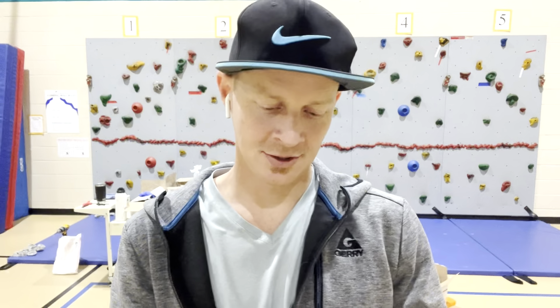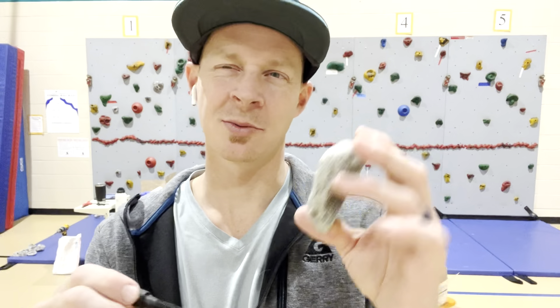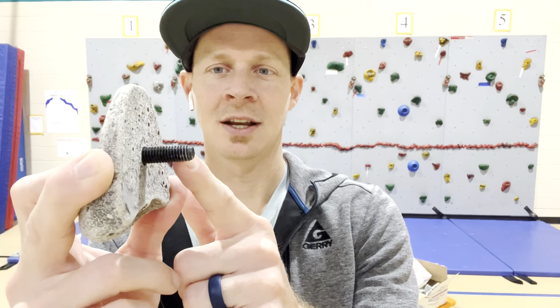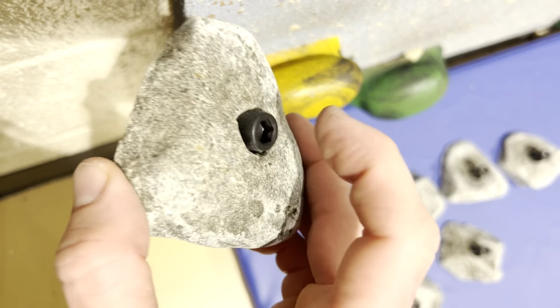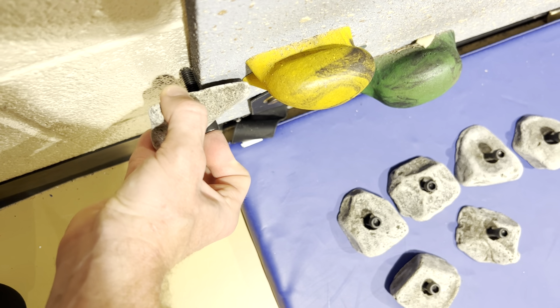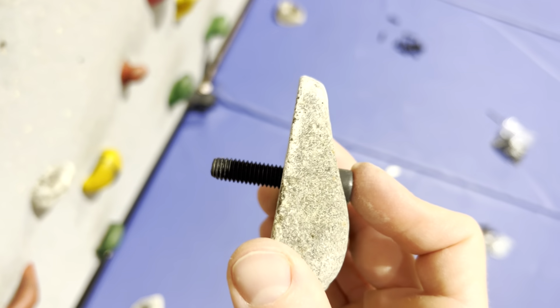Unfortunately I've run into a difficulty with the screw size. These are two-inch screws and I'm going to need to order some inch-and-a-half, because some of the holds — probably about half of them — since I'm going into three-quarter-inch plywood that's on the wall, the plywood will end and then there'll be a bit of the screw that hits the concrete wall behind it. So the screw goes all the way into the hold, and when I put it into the wall there's going to be a gap — it'll hit the concrete and bow the plywood out away from the wall.